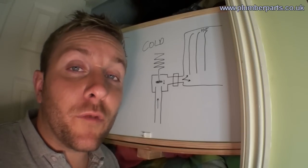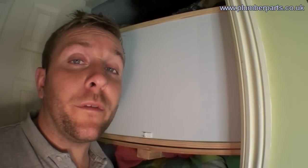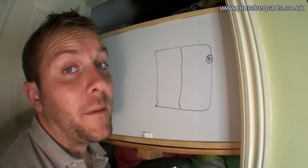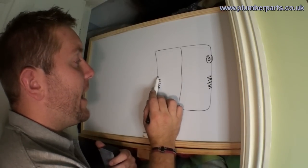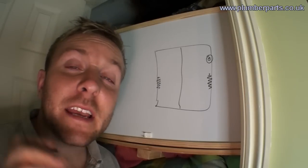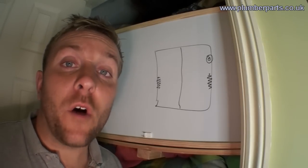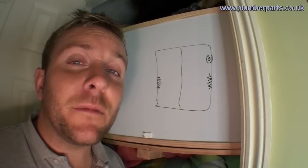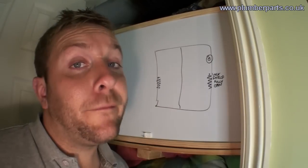Only touch it when you go into the room and it's cold and you find that the radiator is cold. Another thing you need to consider is where you can actually install thermostatic radiator valves. If you have a house with two rooms — in one room you have the room thermostat which controls the whole heating system and one radiator, and in the other room you have another radiator with a TRV on it — don't put a TRV in the room that has the room thermostat in it. If the TRV closes down and the room thermostat is not satisfied, it will never knock the heating system off to the whole house and you won't get any saving. The radiator in the room with the room thermostat should have a lock shield on it that is fully open.